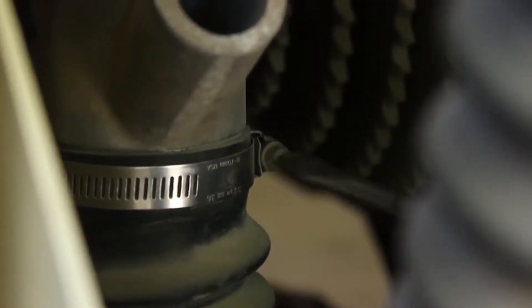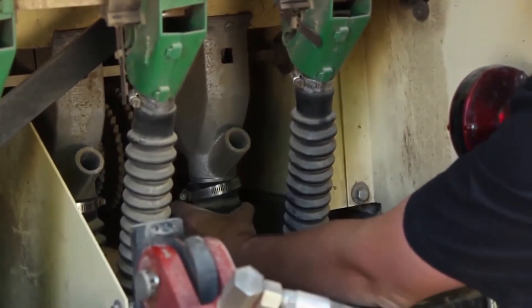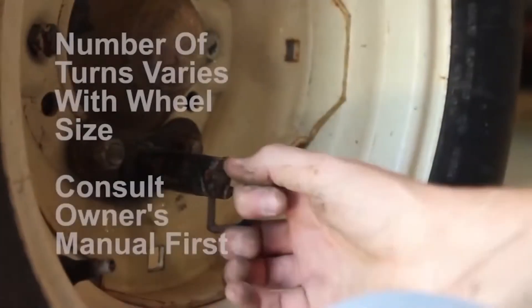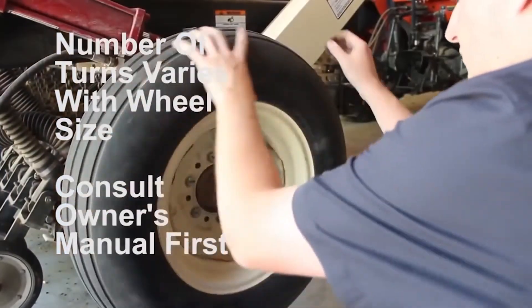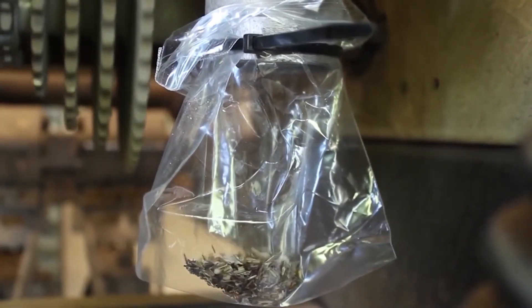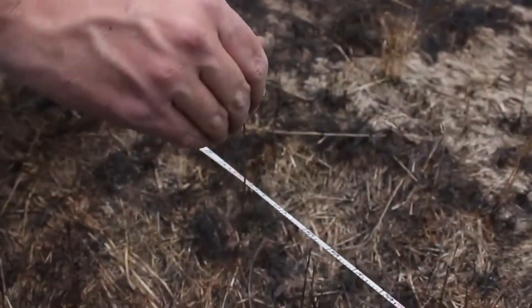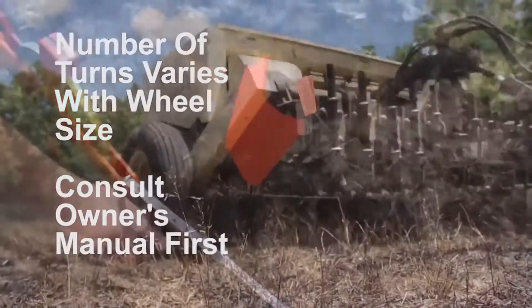Next, pour seed into three of the seed cups and remove the tubes from the bottom of the seed box. To measure the seed output, we will weigh the seed dropping out of these cups. This can be done with the help of one or two extra people holding cups, but when calibrating alone it is helpful to secure bags to the bottom of the seed cups with rubber bands or zip ties — just don't secure them too tightly. Now turn the drive wheel with the pin engaged for 13 and a quarter turns, using the drive pin or tire valve stem as a reference. Make sure the pin is engaged and the drive wheel is off the ground, which may require a jack. If a jack is not available, you can drive the drill 100 feet, which is equivalent to 13 and a quarter turns.